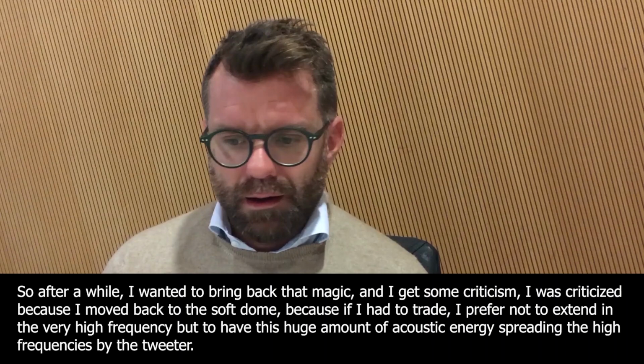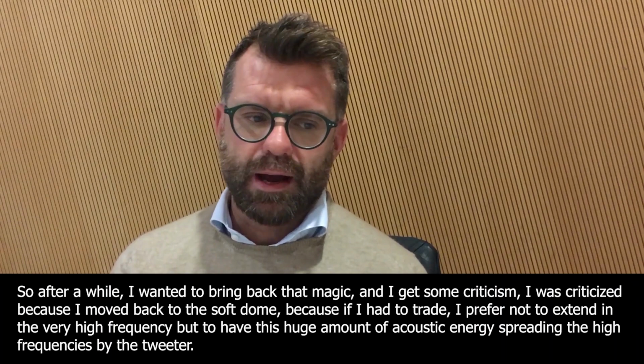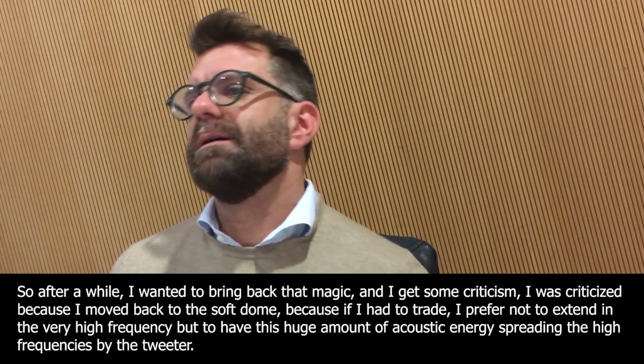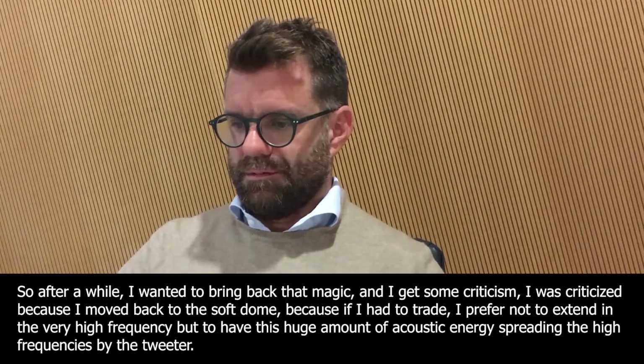So after a while, I wanted to bring back that magic, and I got some criticism. I was criticized because I moved back to the soft dome. Because if I have to trade, I prefer not to extend perfectly in the very high frequencies, but to have this huge amount of acoustic energy spread in the high frequencies by the tweeter.